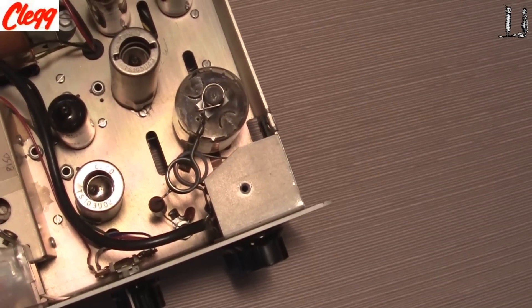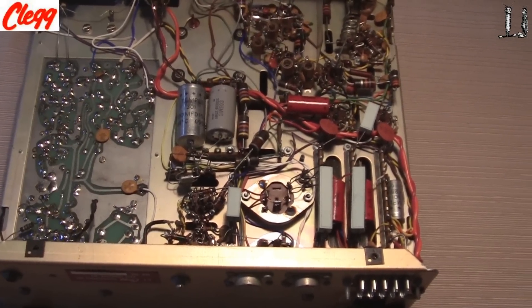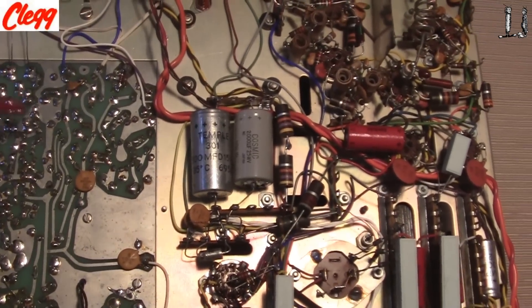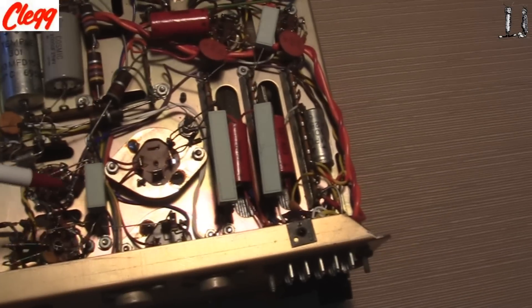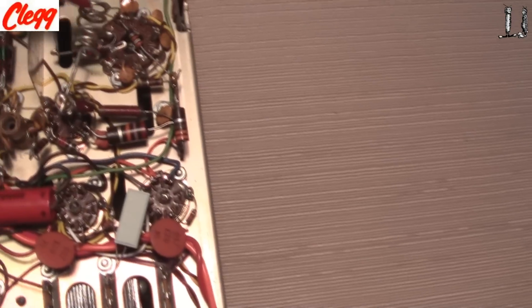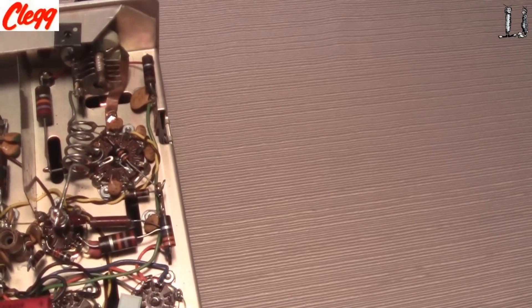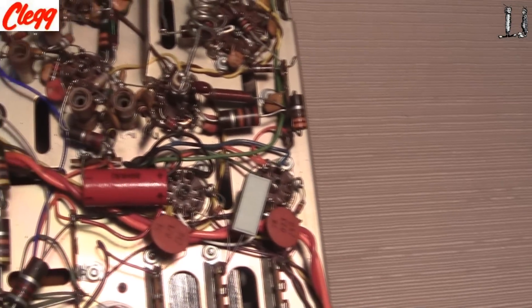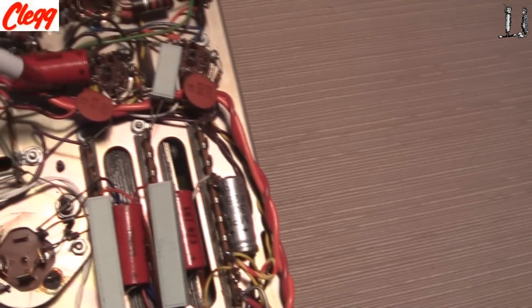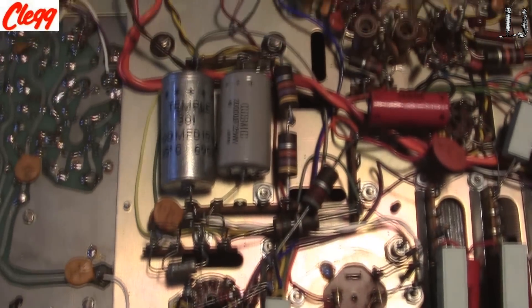Taking a look from the other side, we can see some of these components a little bit better. Looking at the underside of the Clegg 22'er MK. Over here on the left is the bottom of that receiver, with a few filter capacitors and basically discrete components making the system operate. Here's the final transmitting tube circuitry, a little tuning capacitor here for tuning the grid to resonance, some of the tuning circuitry, and oscillator and modulation circuitry back in this area. Not too much to see down here, but it's very clean construction.